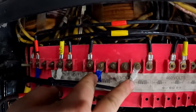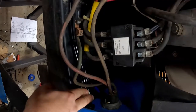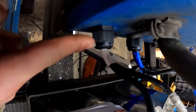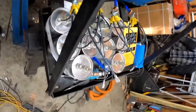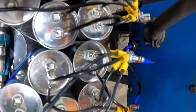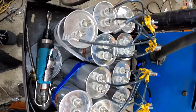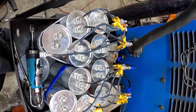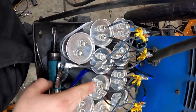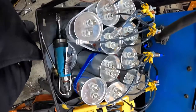These are for your capacitors. The power for the capacitors goes out here, down through here. Because I ended up with enough capacitors and wanted a capacitor bank I could add and subtract to, I ran them through cord grips — cable glands — and out to the back here. I only have one tank of gas, so it's actually a good spot. It won't be wide open to the elements; it'll be wrapped up and the whole thing will be in a box. It makes the wiring simpler and easier than stuffing them in the back of the welder. Also, if these capacitors go bad, they can explode, and because they're oil-filled they can make a mess. If I put them in their own enclosure, the chance of them screwing up something inside the system just goes away.